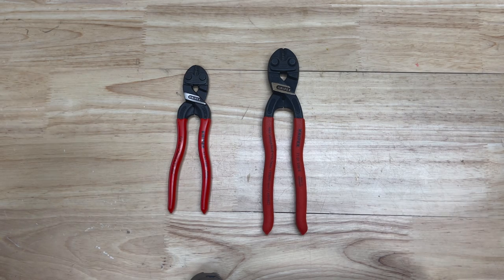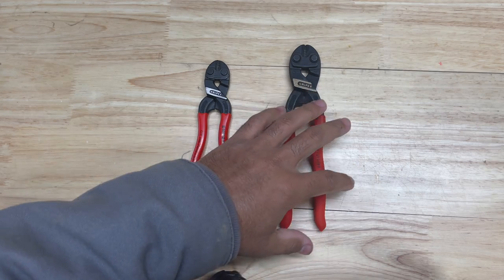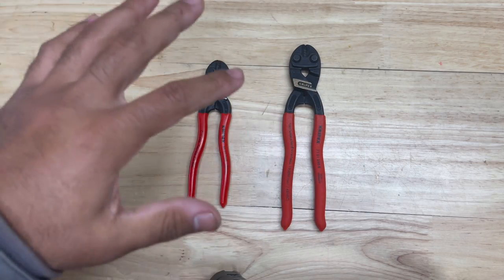There's a difference in hardness between piano wire and hard wire. You have soft wire like copper, then medium-hard which is going to be like nails, then hard which is closer to a screw, and then piano wire which is high-carbon spring steel — much harder than regular screws or regular hard materials. So those are basically the four hardness categories they rate these cutters on. The R variant is not rated to cut that higher echelon of hard material like spring steel and piano wire, but it is a more resilient option because it's a softer metal.